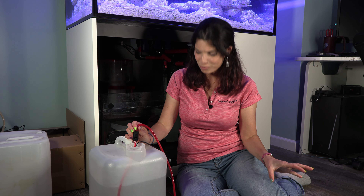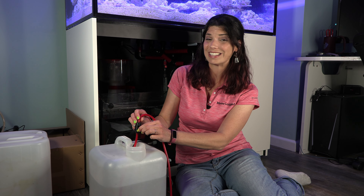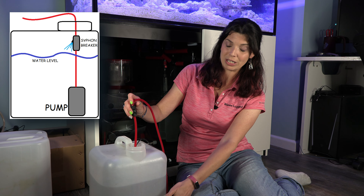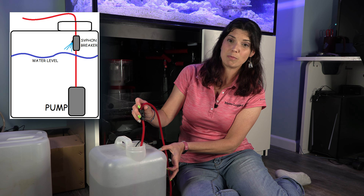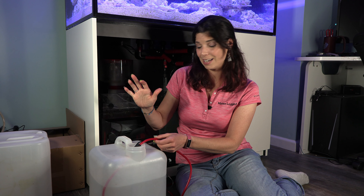One thing you should be mindful of with any sort of plumbing work — you always want to check for leaks. I was double-checking everything and noticed I had a leak at my siphon break. The reason for that is I missed a step in the instructions and installed it wrong. There's a tiny hole right here underneath the arrow, and that was the siphon break — I needed to shorten the length of hose going down to the pump so that it sits just above the water. I've got to shorten this up and make sure the piece is in the correct direction, and then you'll be good to go. I haven't decided quite yet where I'm going to install the water leak detector, so I'll show you that hopefully in a future video.